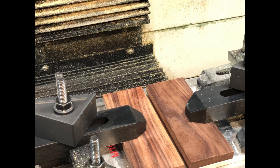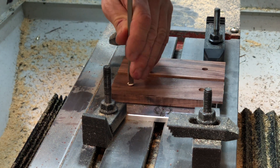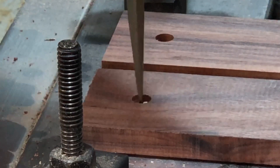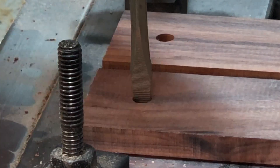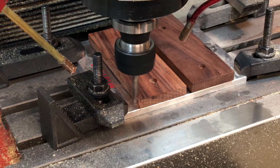I've clamped the blanks to the fixture. Off camera I machined the counterbore — this will allow me to install the three bronze screws that I just made and one pan head screw. As it turns out, a pan head screw will work, and before somebody points out — yes, I know that is not a pan screw. Thanks for noticing.